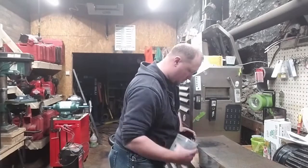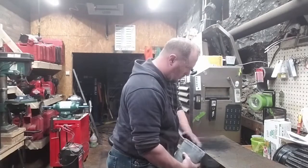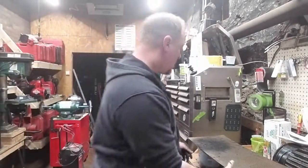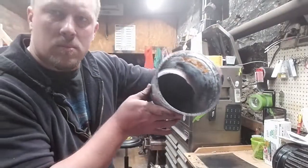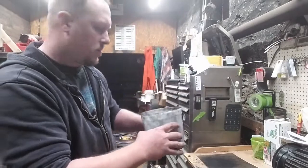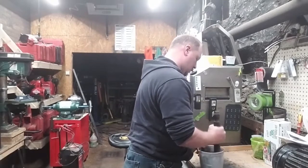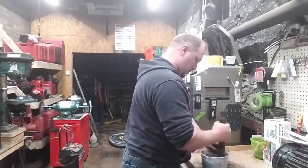Carbon in iron seeks a kind of homeostasis, and ordinarily we experience that as decarburization. Young smiths will often experience decarburization of their work because they keep placing the work back in the forge to get it right, because they're not efficient with their metal shaping yet. And that's okay. It can be easily fixed by grinding. So we say forge thick, grind thin.